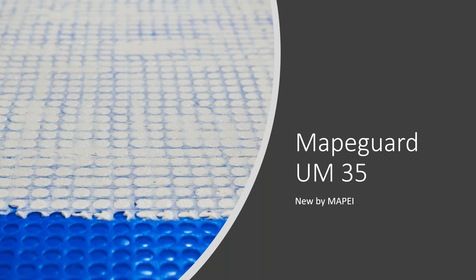How would you install a shower drain with MAPEGUARD UM35? We do not recommend MAPEGUARD UM35 in showers. We offer a different product called MAPEGUARD WP200, and we would recommend that product be used in a shower. The drain is the portion of a shower installation that could possibly leak, and from a technical services standpoint, our choice is to use WP200 — there's just less risk for all involved.